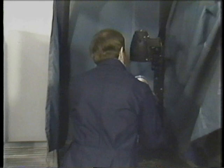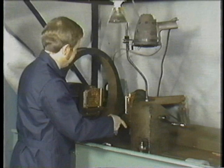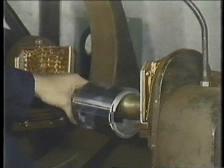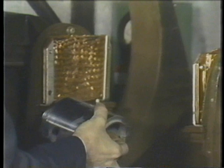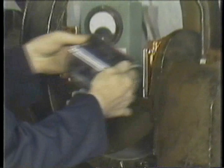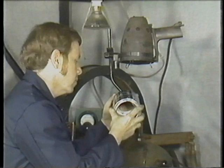The developer is allowed to dry to a powdery white surface and then the part is placed under the black light to check for cracks or inclusions. The second part of non-destructive testing is to magnetically inspect the parts. The piece is placed within the plates, magnetized, flooded with materials, and inspected under the black light. The second method is to place the part in a large coil, again magnetizing the piece, flooding it with materials, and checking it under the black light. These two processes are required at TBO and cannot be performed by the mechanic in the field.